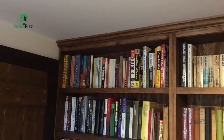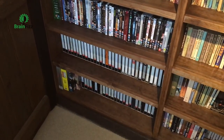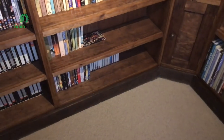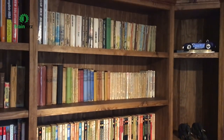As I said, the shelves were screwed and glued into the sides of the bookcases, basically to make very simple but strong boxes. The front of the shelves then get lipped, as you saw, and the back of the shelf gets screwed straight through the back of the carcass — making, in this case, two very heavy, solid bookcases for paperbacks.